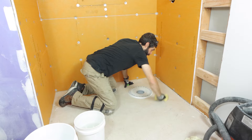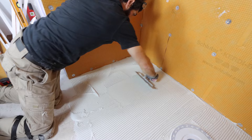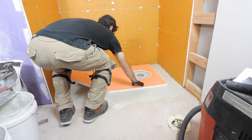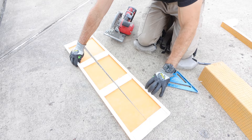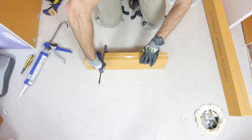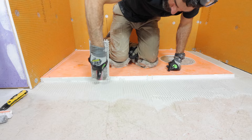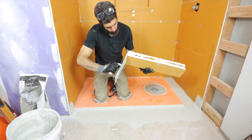The next step is to add your shower tray. I recommend wiping down the surface to dampen it, then apply thinset using the flat side of the trowel, then the notch side. The most important thing is to hold that 1/4-inch by 3/8-inch trowel at a 45-degree angle when applying the thinset — this maximizes coverage so when you set the shower tray and walk on it, you'll fully bond the tray to the floor. I also customized the shower curb by cutting it in half and bonding it back together using KERDIFIX to minimize the width. If you want a smaller curb you can totally do this — just let that KERDIFIX set up, then bond the curb to the shower tray, the walls, and the floor using thinset mortar.